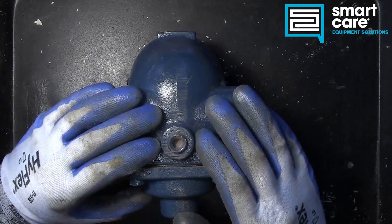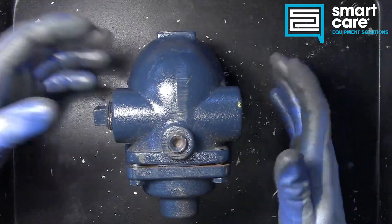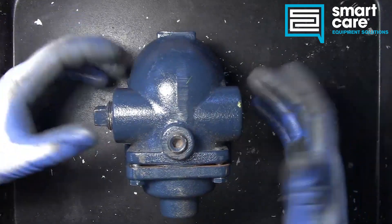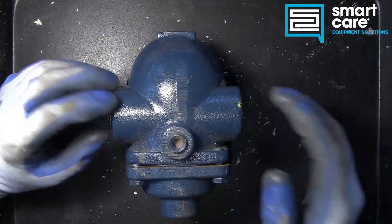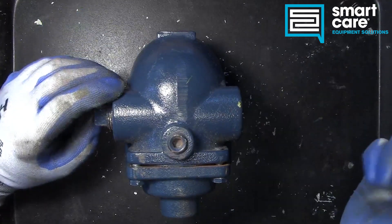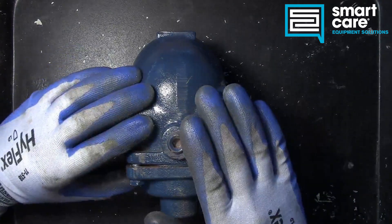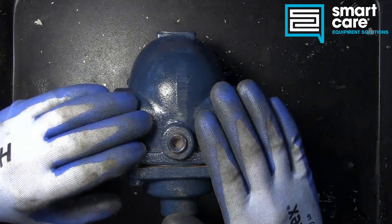These are really critical because you don't want steam flowing through the system uncontrolled, but you also don't want water sitting in your steam system where you're trying to pull heat energy out. To keep steam in the part of the process where you need it, you feed it in, put a trap on the outlet, and let the trap regulate condensate exiting the system.